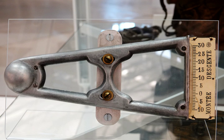Inclinometers include examples such as Wells' inclinometer, the essential parts of which are a flat side or base on which it stands, and a hollow disc just half filled with some heavy liquid. The glass face of the disc is surrounded by a graduated scale that marks the angle at which the surface of the liquid stands, with reference to the flat base.